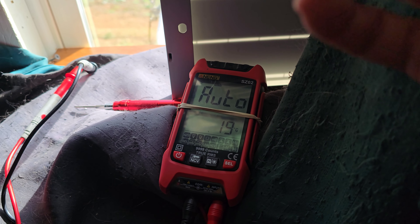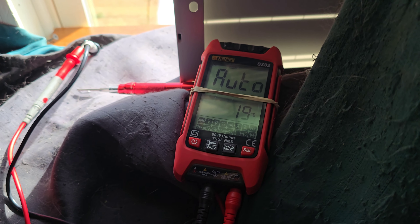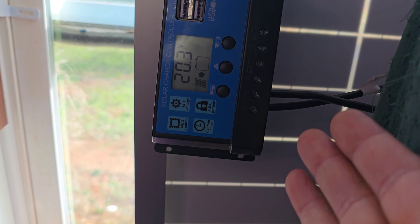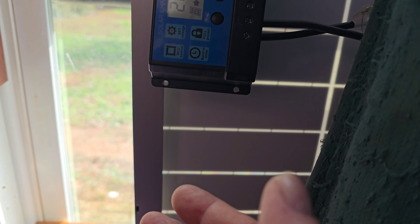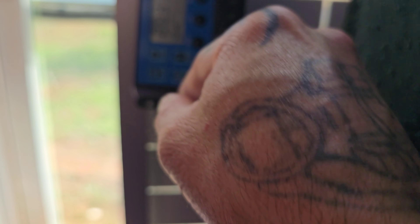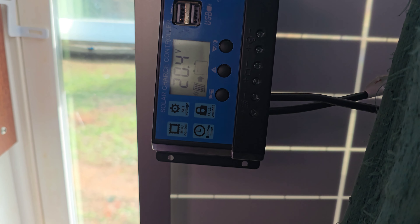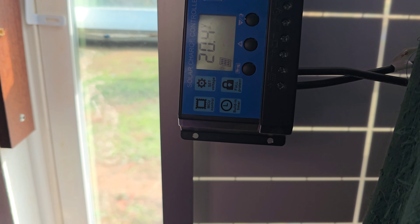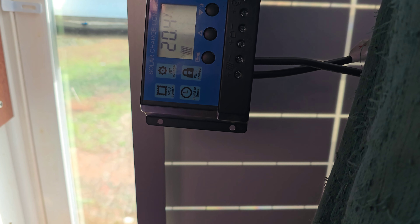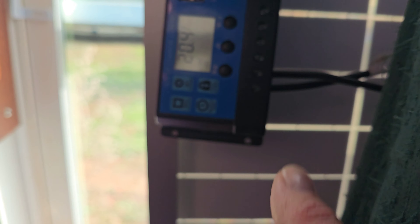But if I connect the buck converter directly to it, I can't get anything out of it. So I guess I really am going to have to hook a battery up to this and just see what it does before I can actually do anything. I'm getting the feeling that there's not really any circuitry inside here and it's just a direct connection to the solar panel. I think I got this thing off of Temu for like five bucks, so it shouldn't really be a surprise. But with all the issues I've had trying to set up this solar node, this may have been the problem all along.